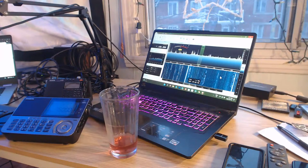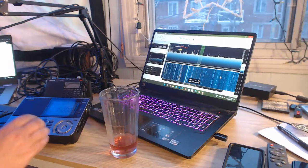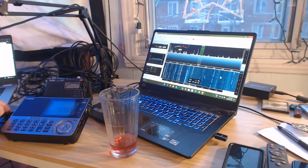Barry, I'm going to have to figure out the interference issue between the laptop and DX390. Annoying radio is on the other side of the room. Yeah, that happens quite a lot. Sometimes it's cables. If you have a desktop computer, it could be the cables. If it's a laptop, the power supplies of some of the laptops are bad for noise levels.